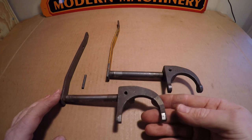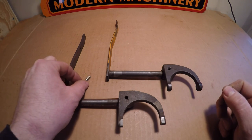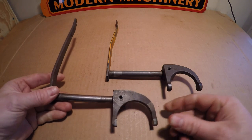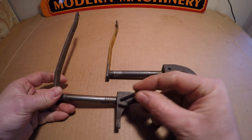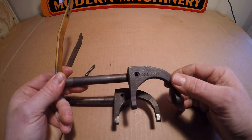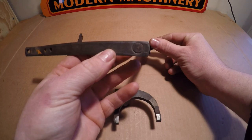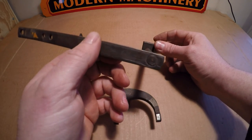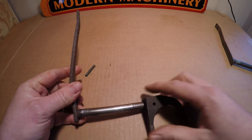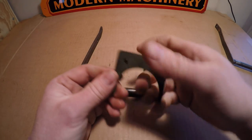I am going to do some work to X231's governor fork and shaft to correct some wear on both of those pieces, but first I want to compare them to the 10A production equivalents that come out of a 445. Dimensionally everything's the same, just a few minor differences in their construction. X231's governor fork is retained to the shaft by a roll pin driven right in that bore, whereas the production version uses a single tapered point set screw. Also the production 445 external lever looks like it has the shaft actually staked into it, and X231's lever has just been hand brazed on, so the prototype parts definitely have some shop-built attributes to them, but I'm going to start by working on the governor fork itself.